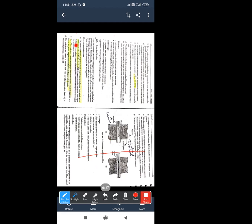Now you can see the operation descriptions they have given. The process uses two flat and a larger cylindrical shaft, water cooled copper electrodes. Over here the copper electrode cylinders are used because they have good electrical conductivity. From here more power can be supplied for the generation of heat in the welding process, while pressure is applied by the movable cylinder. The electrodes are connected to a step down transformer, from where AC or DC current can be utilized for welding.